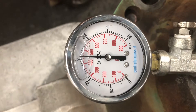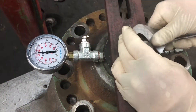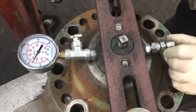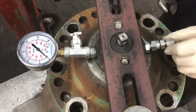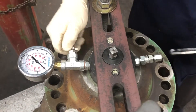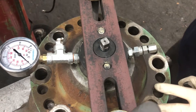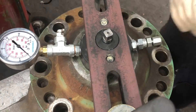This inflating screw is supposed to be torqued to 25 foot-pounds, but I like to make sure because this is a very labor-intensive process to replace. So it's worth taking a little extra step to make sure it's tight. Once we know that there's 32 bar in there, we do the same leak check: close the filling plug, close the bleed-off screw. We've got zero PSI reading on the gauge, and we know that there's 32.5 bar in here, which is about 470 PSI. So if we were leaking by the screw and that inflating screw seal, the gauge would come up — but it's not.